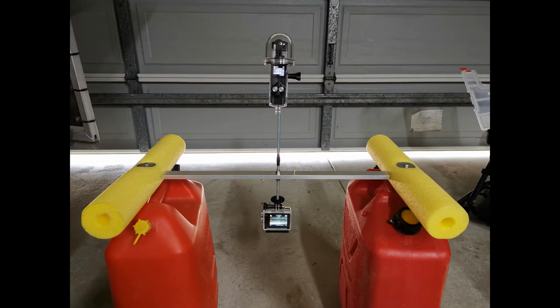And that's pretty much it finished. You've got some little tether points there that you just screw into the aluminium. Just drill a little pilot hole and screw them in, and then you can run a lanyard from them to your camera so that you don't lose your camera if something happens. And you want to check, depending on what kind of camera you got, that you've got a clear, unobstructed vision of what you're trying to record.